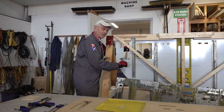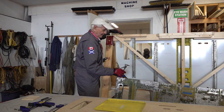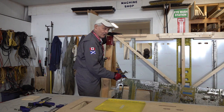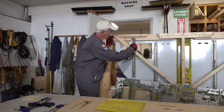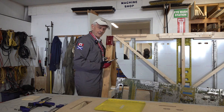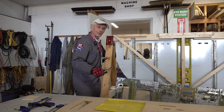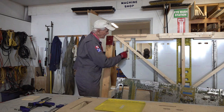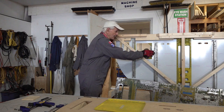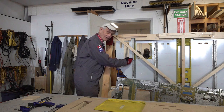As you can see, this stiffener has been placed in position per the location on the original drawings, which had a single mounting hole to locate it. And I located it by means of these temporary rivets called clecos. So now each stiffener is located in the correct position and can now be match drilled through